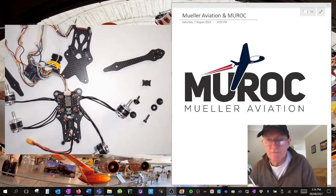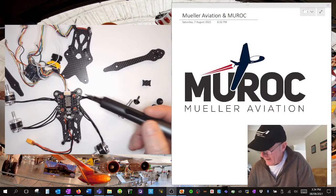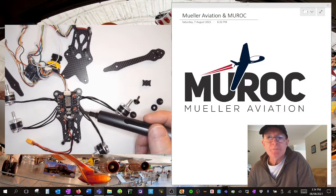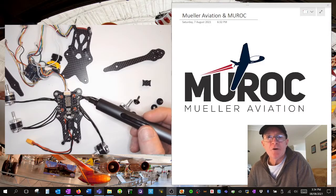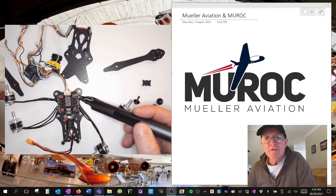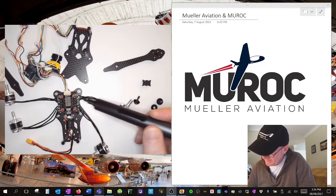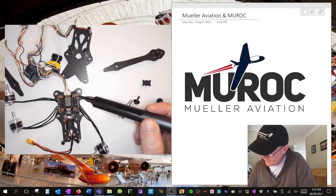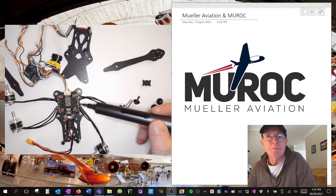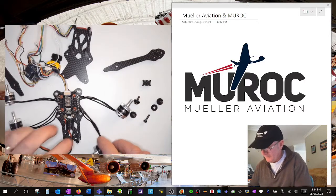Now, I'm telling you that because if I get these motors around the wrong way, if I get these wires soldered up the wrong way, the motor's going to spin backwards. Won't work. Drone will not aviate. So all we have to do is desolder. Pretend this is my soldering iron, the tip, and just desolder each point and swap any two wires over. Any two. It doesn't matter what two. Swap them over, resolder it, and it'll be fine, just like a bought one.